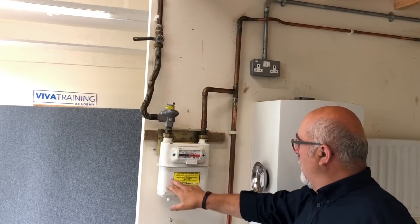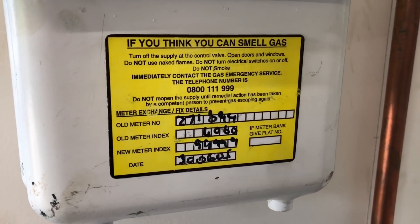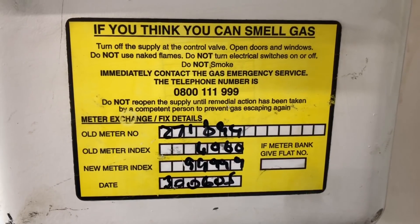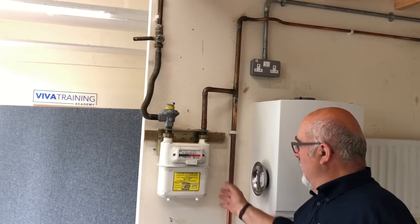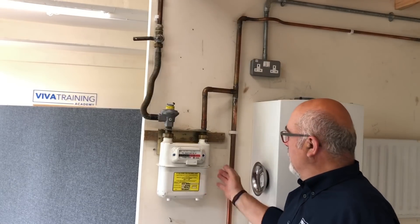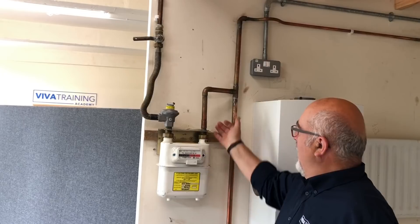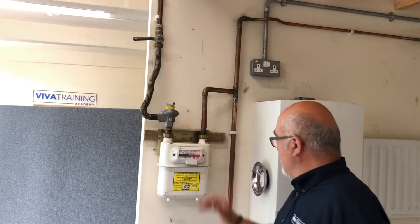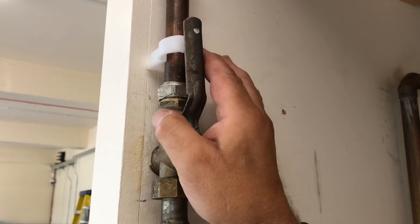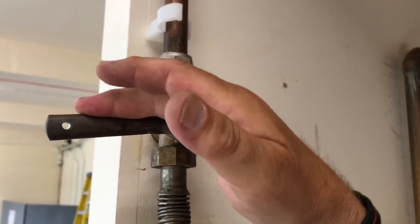You're also looking for a label on the front of the meter. There should be details on here of who to contact in the event of a gas escape — that is a legal requirement. It comes already on the meter but has been known to come adrift. You're also looking for obvious signs of damage. Prior to doing the tightness test, turn the gas off before making any connections with the U-tube gauge or whatever gauge you're using.